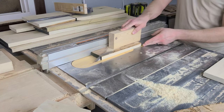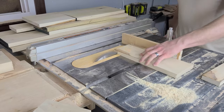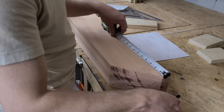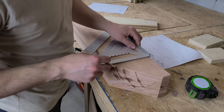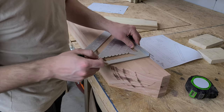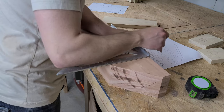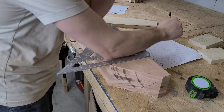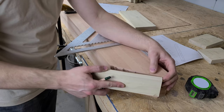We're leaving one board longer so that we can attach some more offcuts to it as reference features in order to get repeatable cuts. Once we have all the pieces cut, we bring them over to one of the timbers. We start by measuring and tracing out our cut pattern using the speed square — and oh no. That's the frozen shock of a man who just realized that he cut the chamfers at 45 degrees instead of 60. That means there won't be enough material on the underside of the board to put the rope to hang this bed.